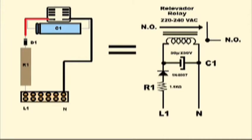Assume R1 is a 1500 ohm resistor, but the final value requires calibrating the device so it will turn off the fridge at the appropriate line voltage. Capacitor C1 is 40 microfarads at 350 volts, which has a minimum voltage value acceptable for a long useful life, so it can also be a 450 volt unit.